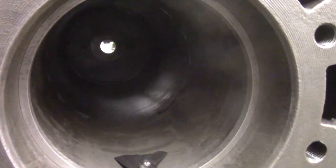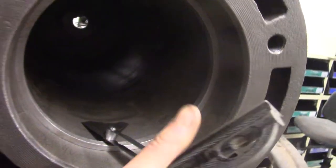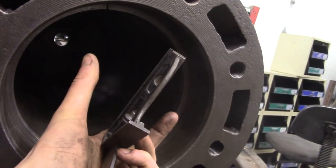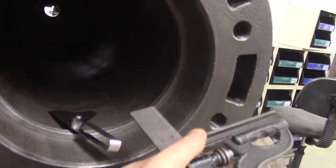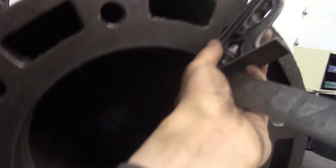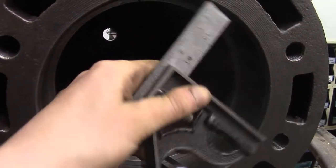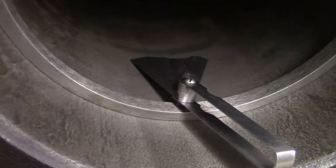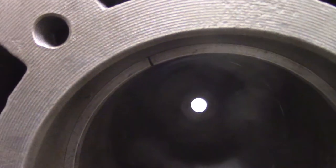So I installed the ring in the bore, and you want to make sure it's square in the bore. If this was a much smaller engine, you could just take the piston and push it in to make sure the ring is square. But that's a little bit challenging with a piston that weighs close to a hundred pounds, so I'm just using a square. I put the piston in a little bit by hand and push it in with the square all the way around to make sure the ring is not cockeyed one way or the other. Then I just used some feeler gauges — you're probably going to need to use a combination of feelers to add up to sixty or seventy thousandths, whatever your gap needs to be.